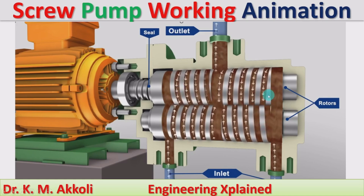During its rotation, seals form between the screw threads and these are called fluid chambers. This creates the positive displacement capability of this pump and also creates suction at the inlet. Thereby the fluid enters between the screw threads through the inlet line and is carried around during its operation.